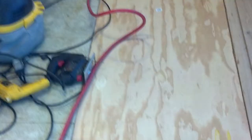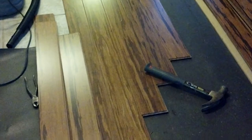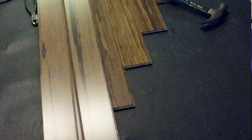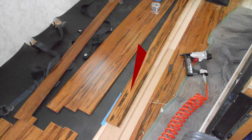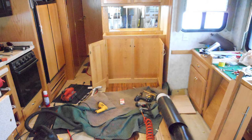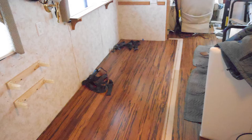Here's an example of how the subfloor looked. You have about 3/4" to make up, so using 3/8" underlayment with 3/8" flooring puts you right at that height, perfectly level with the tile. After putting down the subfloor and before the flooring, I put down an asphaltic paper, again from Home Depot. This piece near the slide mounts to metal, but otherwise you just start at the wall and work your way out, finishing with quarter-round near the cabinet to keep debris from accumulating behind it.